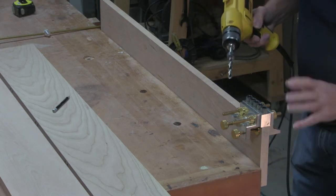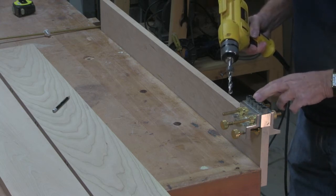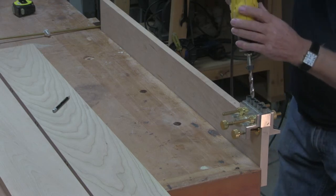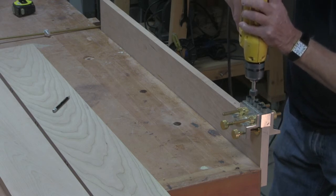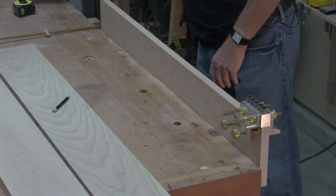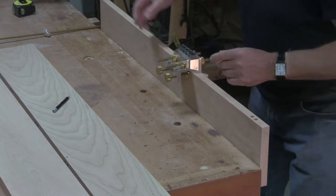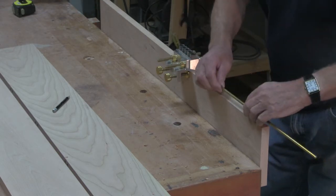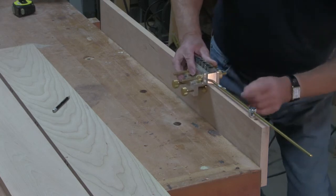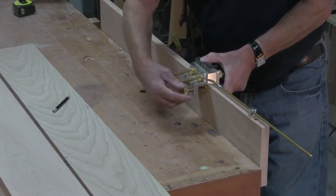And we're keeping away from the edge. Sometimes you don't have to, but on other occasions you do, because we may be putting dowels in from another direction. So we're going to drill 3 and 4. Loosen that off. You'll see how quick and accurate this is. It's all, as I often say, always within thousandths of an inch. There's no other system as accurate as this. Now make sure you're parallel and you're centered up against the rod, then tighten them both equally.